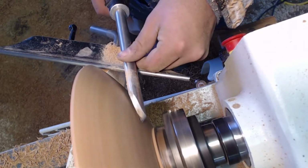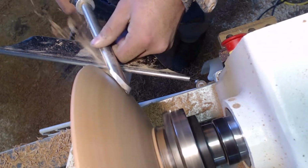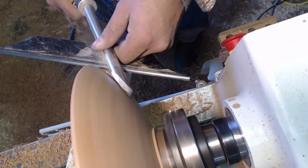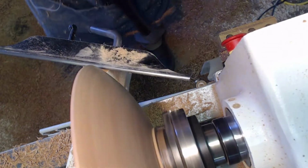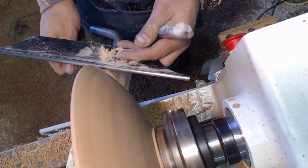And this is now a right-handed cut. I was doing it left-handed before. And that's just a little out of round right there. Once I get beyond that, that noise will kick out. So that is a little out of round right through here. Again, we can expect to see that. We always want to get rid of all of that eccentricity before we actually dive into hollow out, okay? Always want to do that.